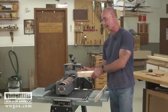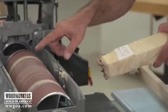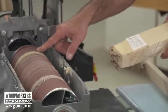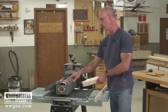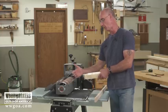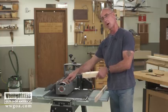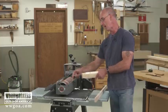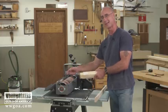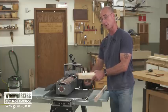The key is that you need to do this frequently. Here and here where it's already so built up, that may not clean because somebody — me — waited a little bit too long. But you'll see in the center what a great job it does. If you wait too long, the sap and resins in the wood will also get into the abrasive. As everything heats up from friction, that will melt, and this isn't going to clean melted sap out of your abrasive.